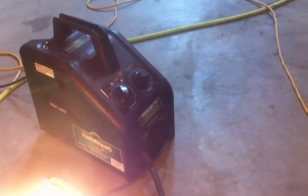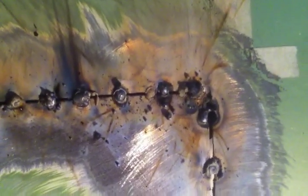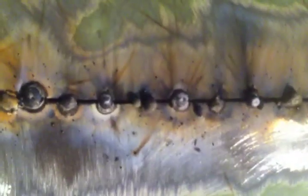I don't know, you guys will probably think differently, but those two felt good, and that was on the last setting that I had, and I upped it to 3, I believe. Yeah, it's on setting 3, and I turned the wire speed down a little bit because it still seemed like it was splattering and not heating up enough. The bead was just bubbling up on top and not penetrating as much as those ones did. So yeah, it's on. It's cool to the touch now.